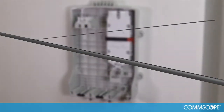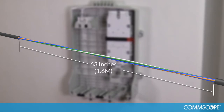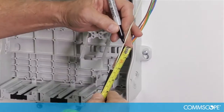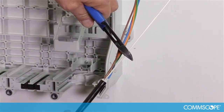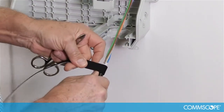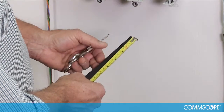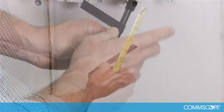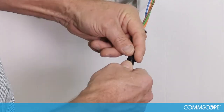Prepare the input cable and remove 63 inches or 1 meter 60 centimeters of the cable jacket from either the stub cable or a mid-span cable. Cut the strength members to a length of 2.17 inches or 5.5 centimeters from the jacket end — for loop cable, this is for both sides. Wrap a piece of felt tape one turn around the jacket end, then cut the felt tape. Cut a piece of foam tape to the length specified in the installation instructions, based on the cable diameter. Wrap the foam tape around the cable at 1.2 inches or 3 centimeters below the hose clamp tape at the place where the cable will touch the cable seal.